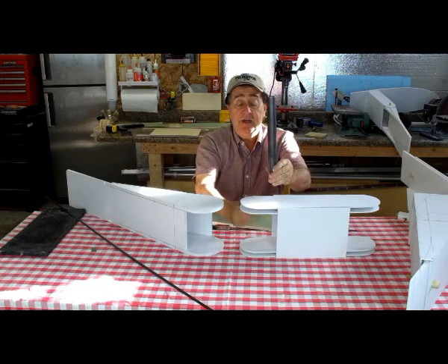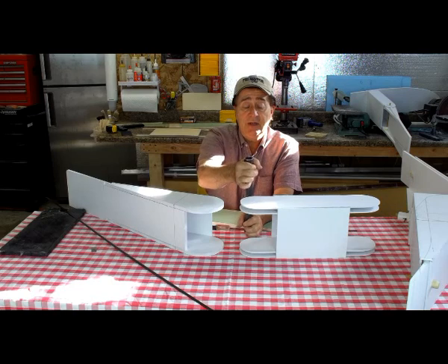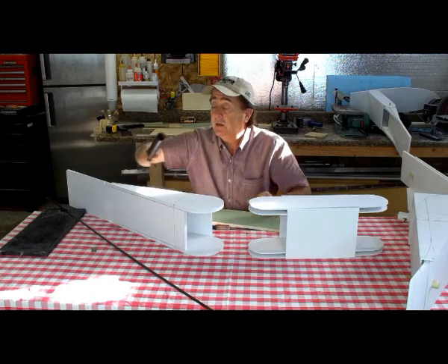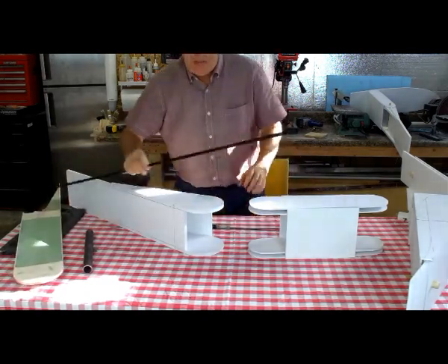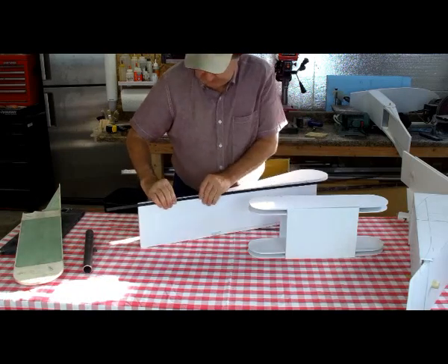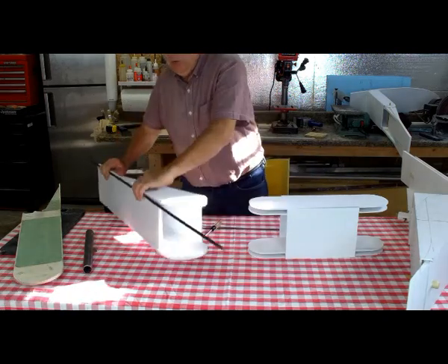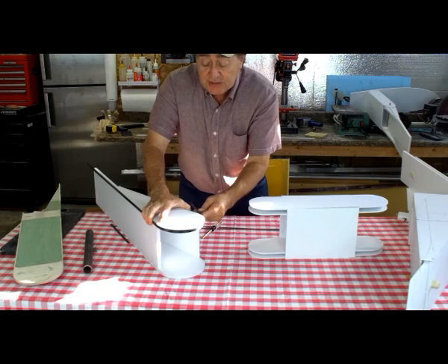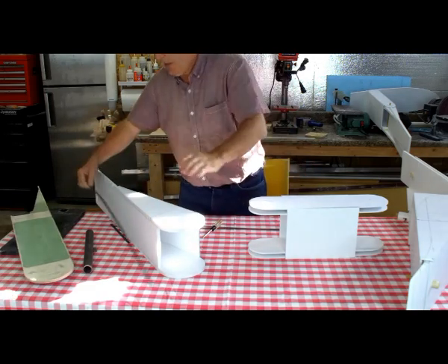The tube goes in vertically — a two-piece system on one fiberglass rod with wood blocks inside and a guide tube of fiberglass — and in she goes. You have metal only where you need it. Rather than running the cap strips on the shear web, I put them on the front face like this — stack them up, put two on the side, and the strip wraps around just like that. The radius was chosen to allow the carbon fiber to wrap all the way around, putting it in hoop stress — a superior approach giving more bending stiffness than the original orientation.